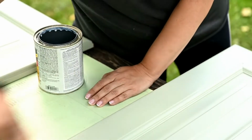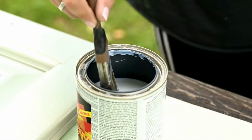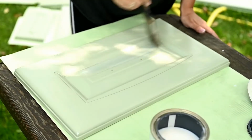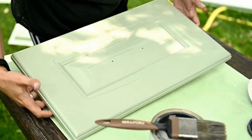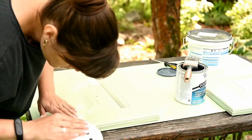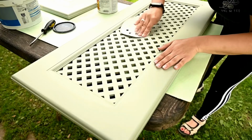To get a perfectly even coating, firstly you need the right brush, a synthetic one with very soft bristles, then brush marks will be minimal. Secondly, pick up just a little sealer on the brush every time. Imagine that you have very little sealer left, like me, and you need to stretch what you have to the maximum. Thirdly, blend the sealer well with light movements, barely touching the surface with the brush. Then you will get an even coating without any brush marks.